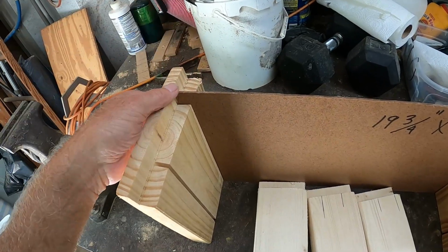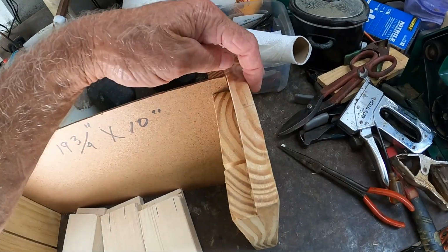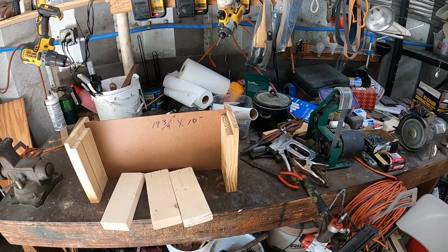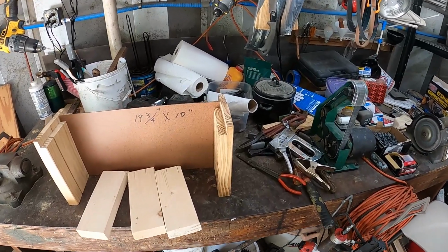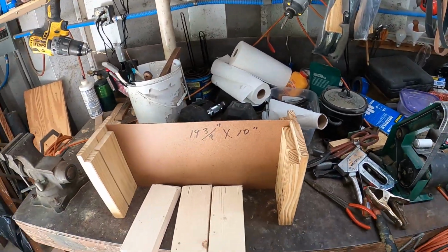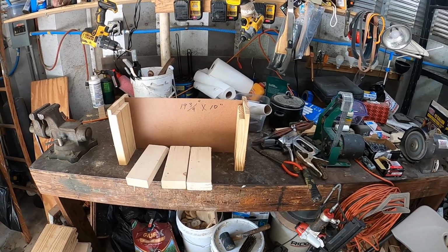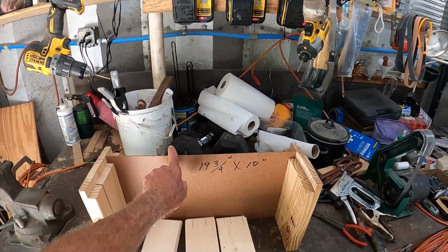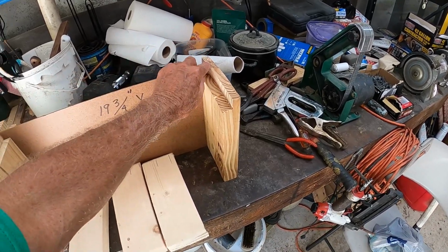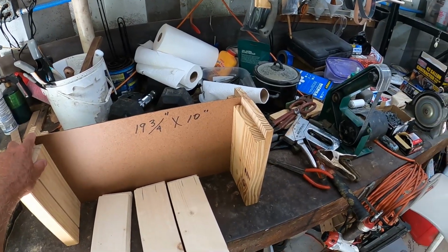Put a little silicone on a caulk gun, just a little shot of silicone here and here. After you're ready to pull your dividers to make it a full five, you can go in here with your Leathermans or a pocket knife and quickly gouge that silicone out of there and stack these up in storage. But you're going to have to be pretty accurate on these cuts, because you obviously need a nice flush top here. You see that, you've just seen out there in the field